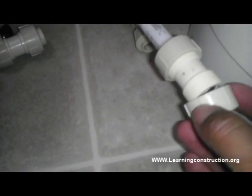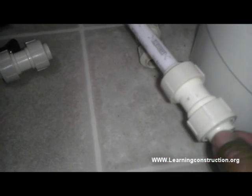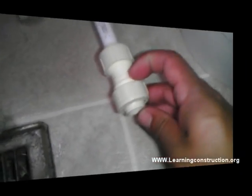One of the things that you are going to want to do is you don't need to take this off — you just want to leave it slightly loose, like this. Before you put the pipe in there, you want to use some soap to lubricate the pipe and then insert it in. The pipe is very important that when you cut it, it is completely straight on one end, and it slips right inside of this guy. It has to be about an inch and a quarter that it is going to get inside.